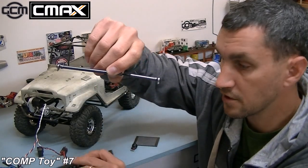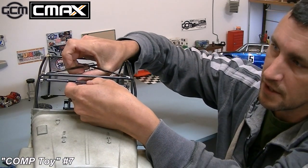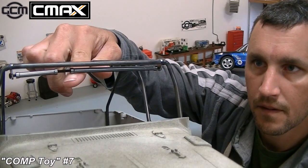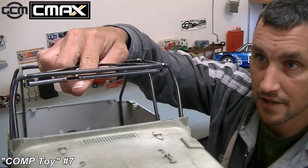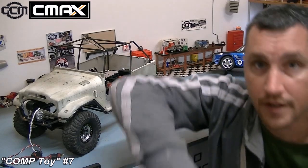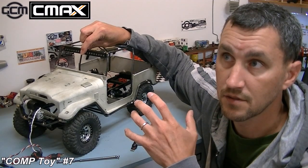And then what you can do is take this — which is all metal and doesn't matter if you heat it up — and then you can put this in your chassis, or frame, or roof rack, or whatever it is. Clamp it in, and then weld the tabs on. Because this is all metal now up top, and so when I'm heating it up and welding those tabs in, I know they're going to be the right width apart. So when I'm done, my light bar will still fit in there. But I'm not going to burn up my light bar trying to weld it on while it's got plastic in there. There's a tip.